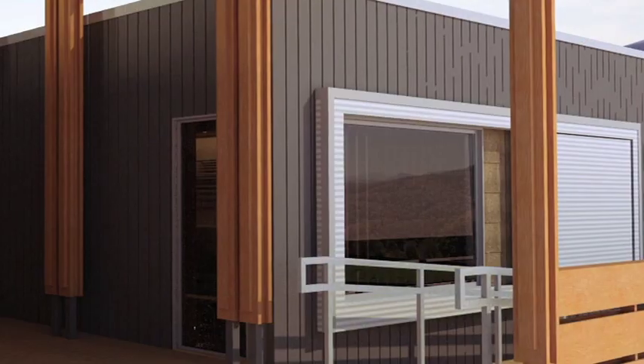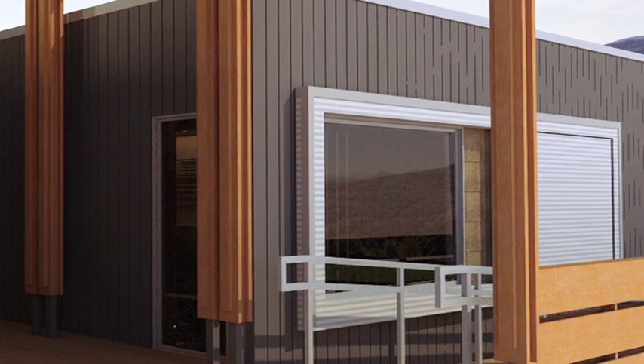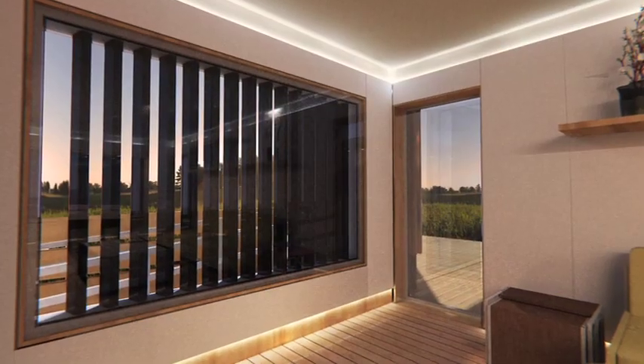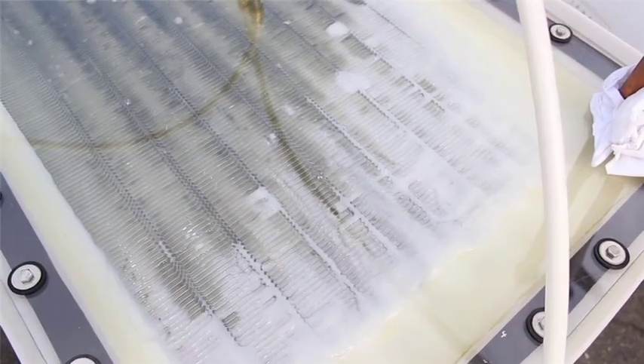One of the new features of our solar homestead is a modern Trombe wall. We use the thermal leverage of phase change materials. They melt at a constant temperature, so as long as you have phase change materials melting, you don't overheat. We melt at about 27 to 29 degrees C. As the sun comes in, you melt the phase change materials — stays warm but not too warm, and we don't have to have as much thermal mass.